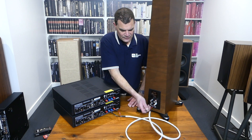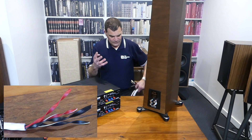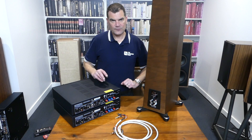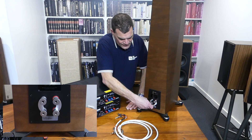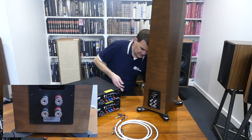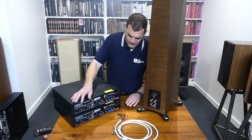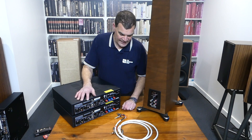The next way of doing things sees a change of speaker cable. The advantage of the Wireworld Solstice is that it is a 4-to-4 natively in its configuration. So you can simply change the plugs on the end and end up with a 2-to-4 or a 4-to-4 configuration, which is what would be required if you're going to investigate any of the upgrades associated with both vertical and horizontal bi-amping. The very first thing you want to do before you even consider doing anything is remove the bridging clips — connecting things with those bridging clips still in place will cause a catastrophic failure, often.